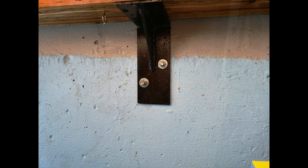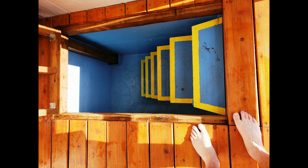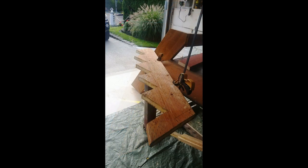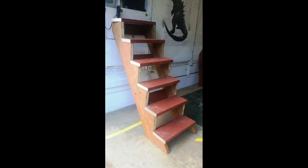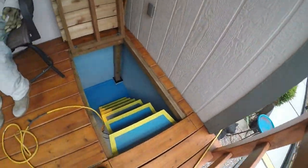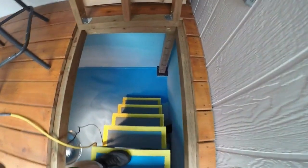It really helps if you know how to weld — I had to make custom brackets to attach the deck to my house. Of course, during non-emergencies when you're using this as storage, you want to build a staircase for easy access. The hardest part about building the stairway is figuring out the appropriate angle for your stringers. But once that's done, the rest of the job is pretty simple — just cutting 90-degree angles, and cutting each tread is simply two cuts with a chop saw. If you're using pressure-treated lumber, ensure the wood preservative stays in the wood by painting it, which also increases visibility, making it easier and safer to enter and exit using the stairs.